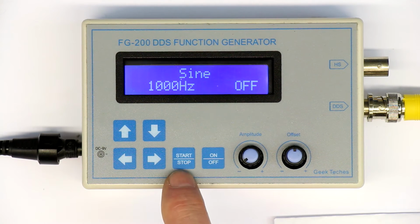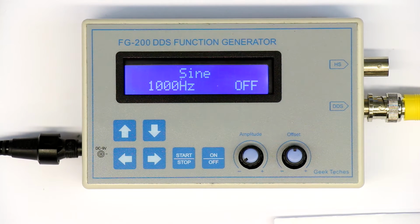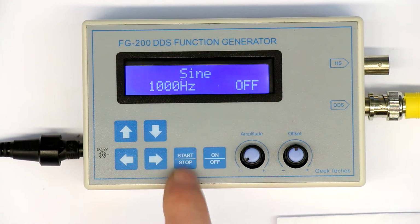The first thing that is a bit annoying is there is some jitter in the membrane push buttons, so apparently they didn't debounce. They didn't put in a software routine to debounce the membrane keys. So that's the first thing that could have been fixed quite easily. Perhaps we can see the bouncing of the keys one or more times.